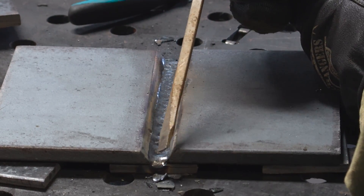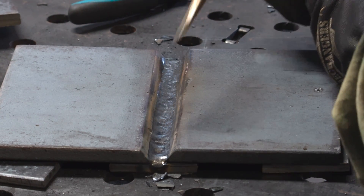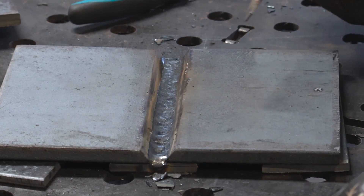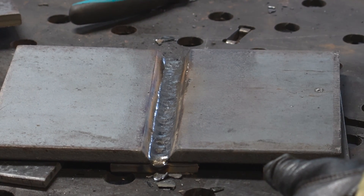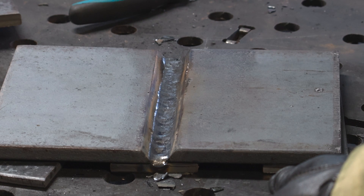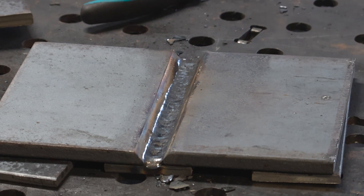Because I don't have a backing strip, I have to start on the bevel and go side to side and let it build up. As I'm going, I'm oscillating side to side and making sure the bead is flowing and tying into each bevel wall equally. I'm on tab and slot tables so you'll see me get hung up and jump a little bit, but that's alright — this puddle is fluid. As long as I keep a drag angle and keep my contact distance checked, I have to keep reevaluating my contact and reading the puddle, making adjustments on the fly. When I get to the end, because I don't have a runoff tab, I'm going to do a little circle to make sure it's not concave — I want a convex profile on the end there without blowing out the base metal.